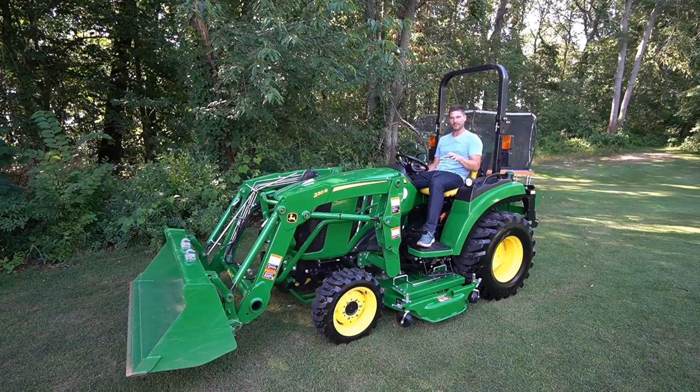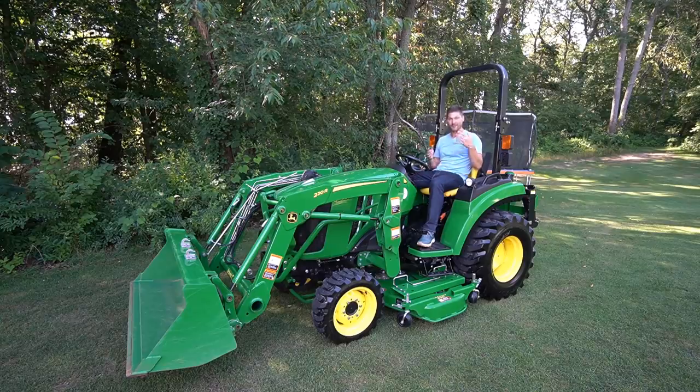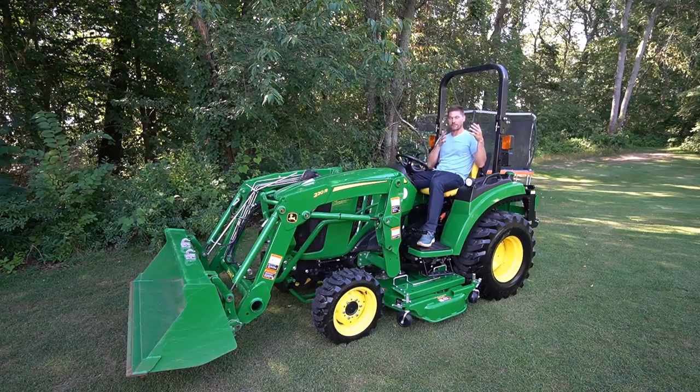You can get tire studs and tire chains, but for me choosing the wrong tire for the application has been an evolution. Tires are not an easy thing to change out — certain rim sizes support multiple tread patterns, but with other tractor sizes you have to get a whole different rim size too. Another example: mowing lawn with a tractor that had old-school bar ag tires on it. After a few passes I realized things were looking rough — it was the tires doing damage to the lawn. That took a few months to smooth out and heal. You've got to be aware of the tires for your application — turfs, ag, and R4s will all excel in certain areas, and some will do more damage or get stuck more easily in certain applications.